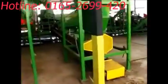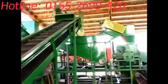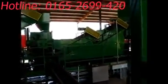It will also go through another blower that removes the light walnuts, the walnuts that have a worm or something in them that ate the inside, or the walnut just didn't grow properly and it's light inside, so it's empty. That machine will blow the bad walnuts out and they'll be tossed. The good walnuts will continue into a floating tank where the rocks will sink to the bottom and the good walnuts will float off and continue to be sorted.